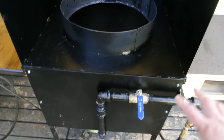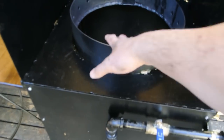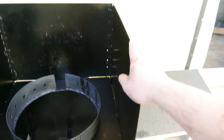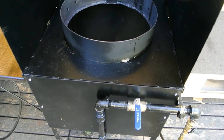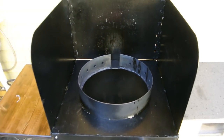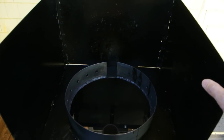The unit itself is built out of angle iron and 14-gauge sheet steel for all of the parts that need structural integrity. The rest, such as the splash guard and the sides, are all made out of 18-gauge sheet steel. I probably could have gone a little thinner but I decided to go thicker so it would last longer and wouldn't rust out.